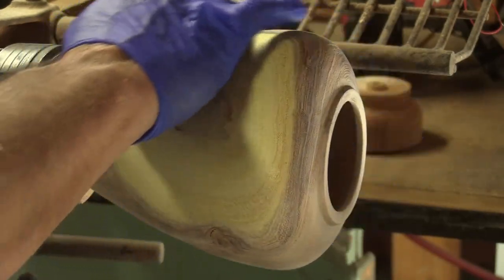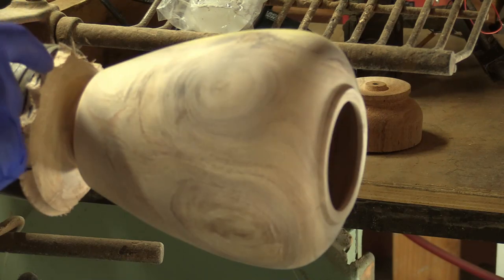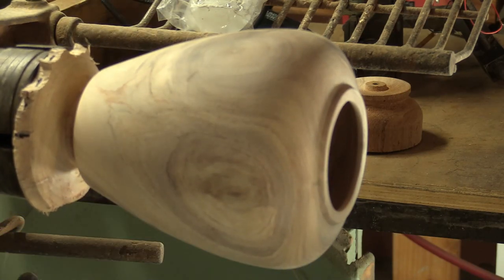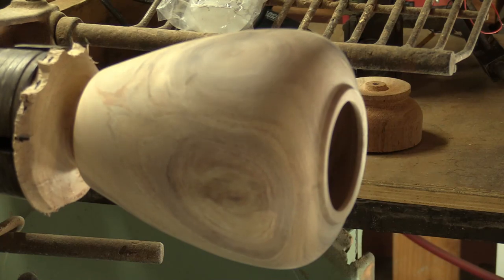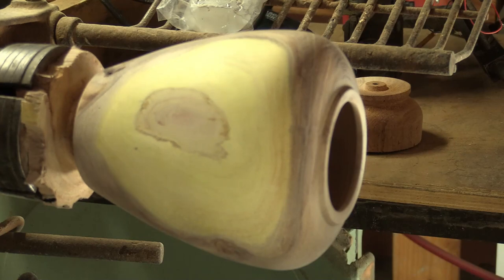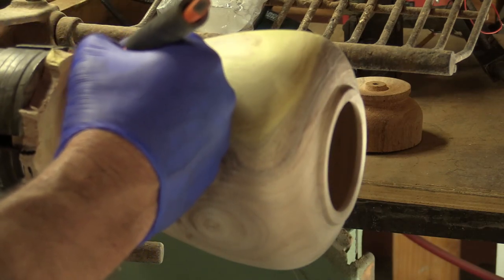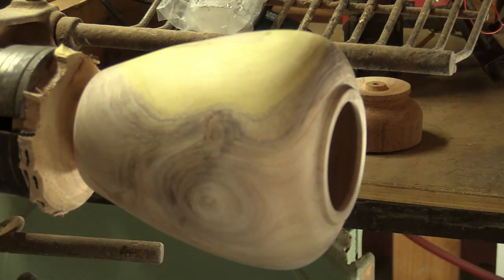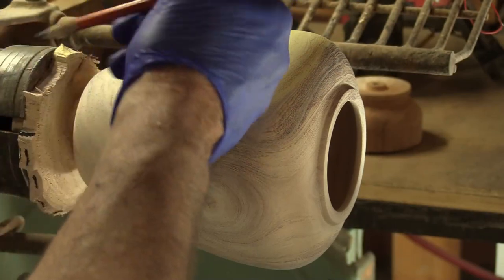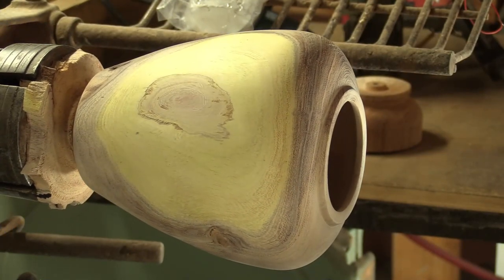I'm back. Here's number three — this is my third jaw. I marked the area where the jaw grips the wood because I'm going to remove this now and we're going to make the lid for it — or they call it a finial. The bottom of this, when I measured it, comes in right about here. Because I did the concave part I kept using a measuring stick — the one I showed you that I made with a 2x2 — and I know there's probably about a quarter of an inch, maybe a little bit less, between that and where the bottom of this will be finished.